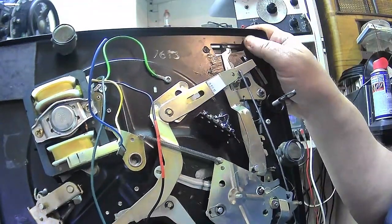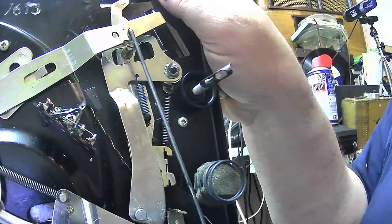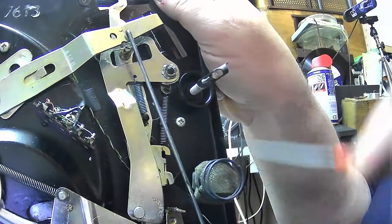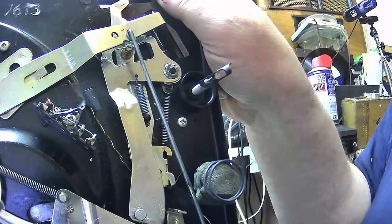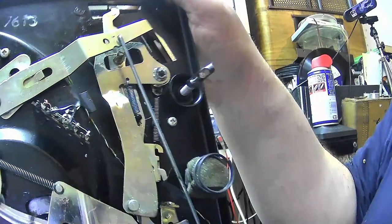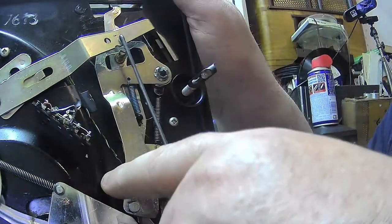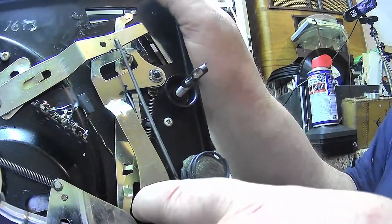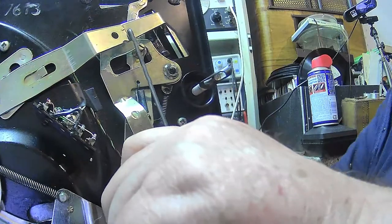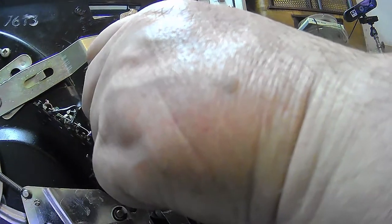There's a spring there, which is our return spring. And no matter how strong that spring is, if that's not lubricated, that won't come back. By the same thing, if this is not lubricated, this will stay up here. And if you operate the cycle, which I will do by hand, try not to trap my fingers, it'll just continuously reject.